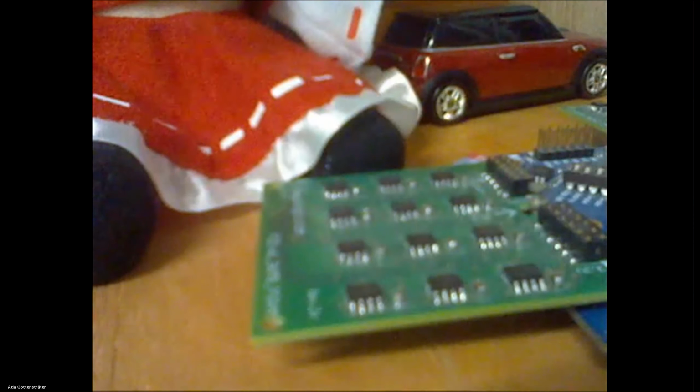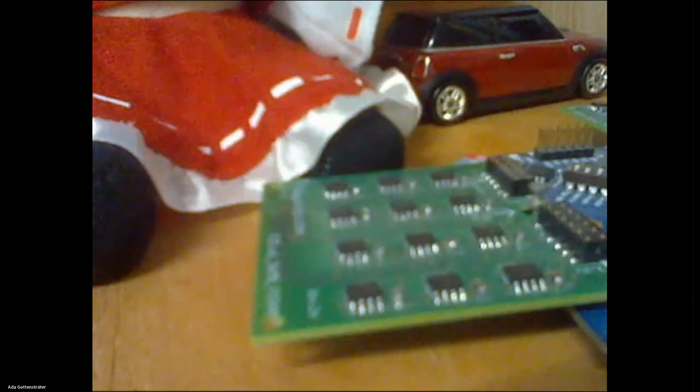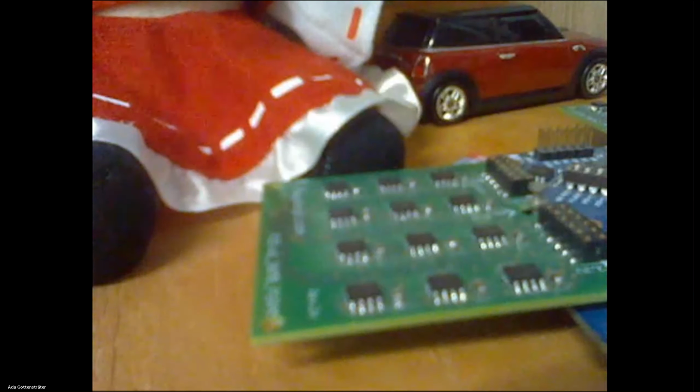If you check on the AP Memory website, you can actually see that they're trialing a die-only version of a 1.8 volt version that has the double capacity. Oh, so it's 16 megabytes. Exactly. But it's 1.8 volts, not 3.3. Maybe they will make a 3.3 version. We don't know. It's currently under development. Contact us. And it's only listed in the section for the bare dice.